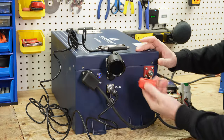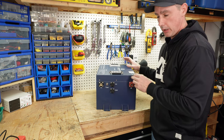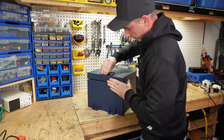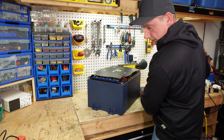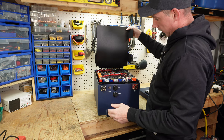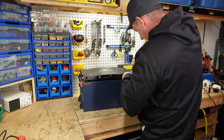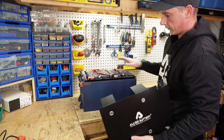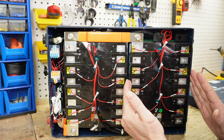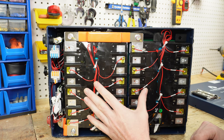They also supply terminal covers that I forgot to mention earlier. Let's open this up and take a look inside. To open this battery there are Phillips screws around the perimeter — I do not suggest you open this battery on your own; leave it to the professionals as this is higher voltage. Inside I can see a gasket running along the perimeter that gives it the water seal. We have a cover plate held on with a couple of zip ties. Looking at the top of the cells, this is two 24-volt packs — one 24-volt pack here and another here — series connected with a bus bar. There is a flexible PCB board on top of the cells.